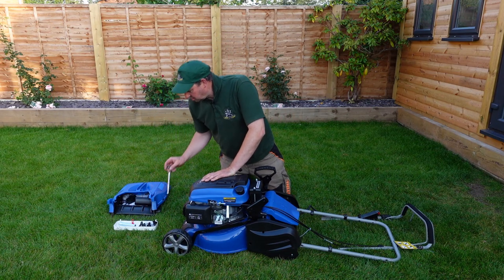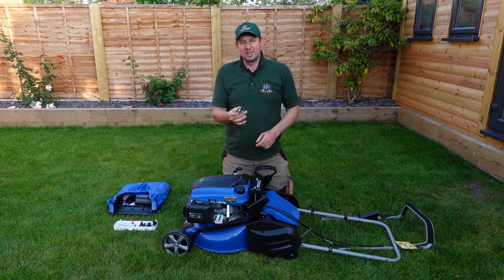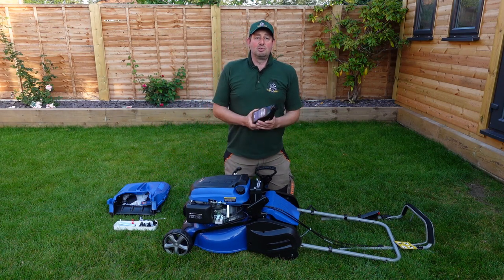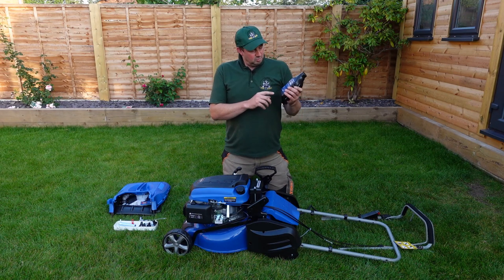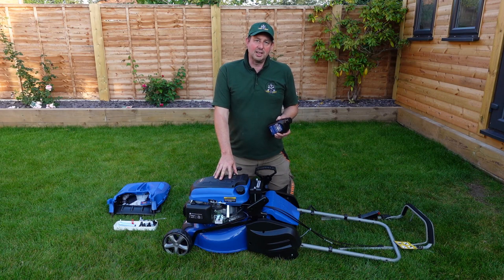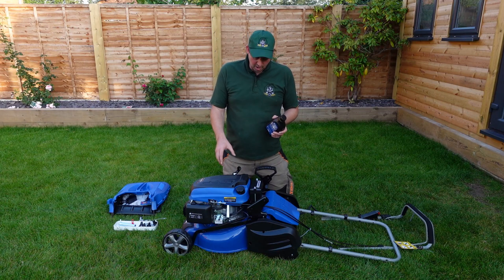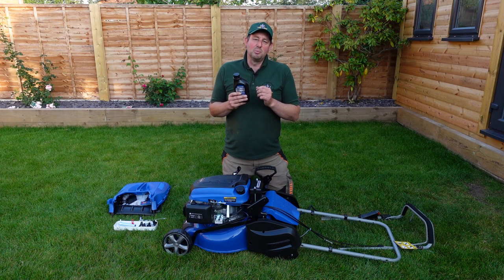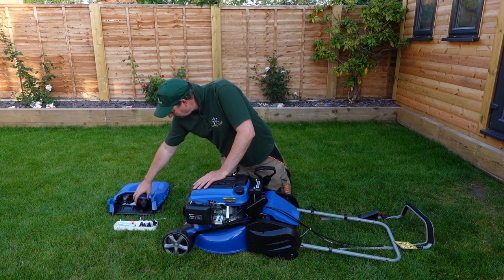The only thing not included in the box is a 13mm spanner or socket — I've got a small 13mm socket that should fit into the gaps. For the oil, it takes 600ml and they send you a 600ml bottle. Put about 90% in, test it, and it should be about right. In the UK, machines are shipped without oil, but they have been filled and tested at the factory, so when you pull the dipstick out there will already be some oil on it — don't just tip the whole bottle in or it'll likely be overfilled.